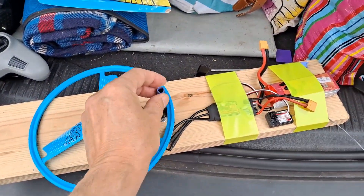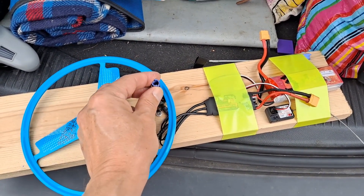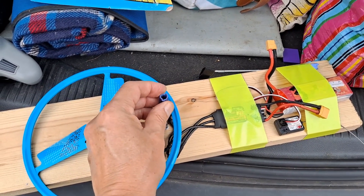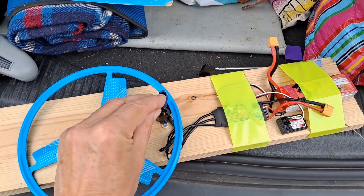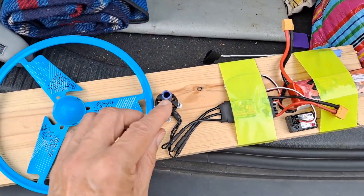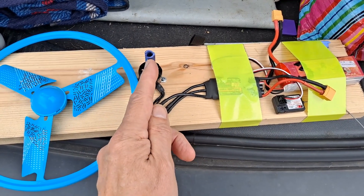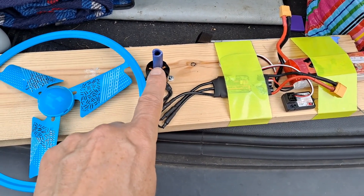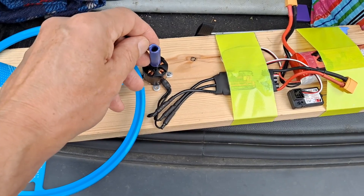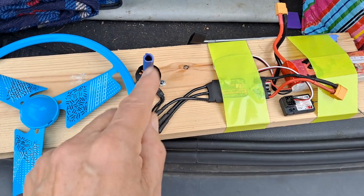So I've done a new — I think it was called Dog Tooth Cog, or Dog Tooth Clutch — it's this spiral thing that grips on the bottom. I printed that one horizontally instead of vertically, which means the stress lines go up and down instead of across. Because yesterday when we tried it, we just knocked the teeth off when it went fast, because the stress line was around there. So the theory is it should last a bit longer this time.